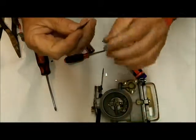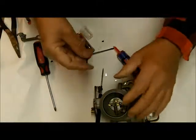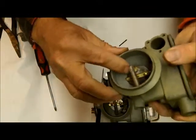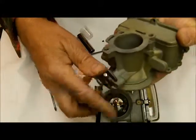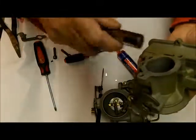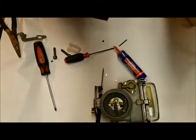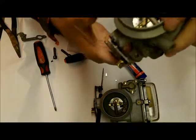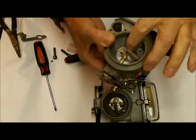We've got this little pin that goes in it. Which way did it go? This is another one that's easy to mess up. What I did — the pin goes right in the middle, here's one here, you can see the pin on it. What I did was I found a socket to take up the slack. I put the socket in the vise and then hold that over it so that I can force this out without banging on this.